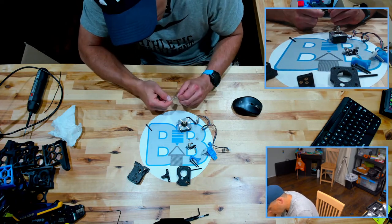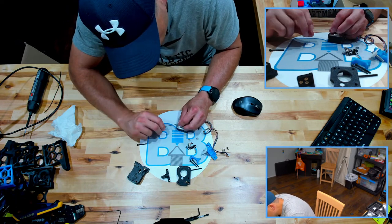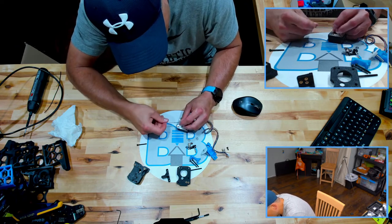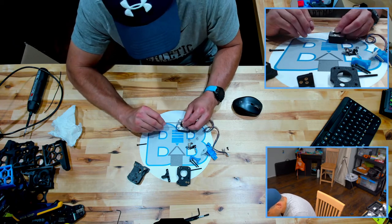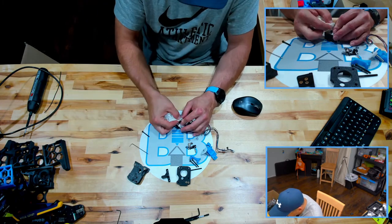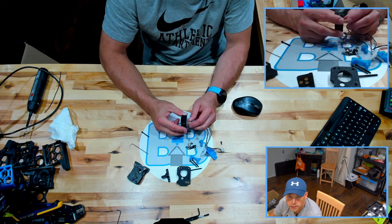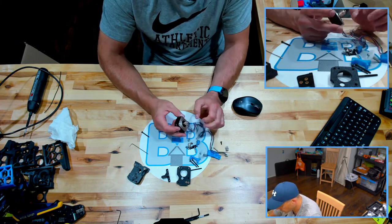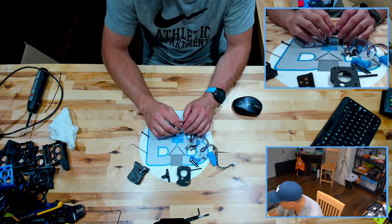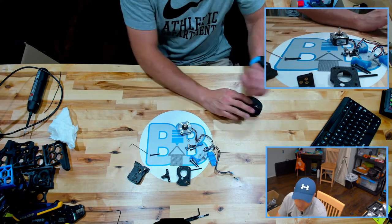This is a pancake stepper motor. There's a fair amount of torque required for extruding, but not as much as some of the other movable components — you're just pulling and pushing the filament. This will save a ton of weight on the hot end, on the complete Afterburner setup. I'm going to guess this is probably half the weight, which will help with ringing and a bunch of other things.